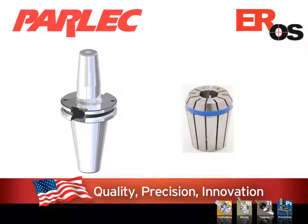Over time, when the bore of your shrink holder wears, you will need to replace it. It is quality scrap metal. The 2-micron collet of the ERos system can be replaced at a fraction of that expense, and as an added benefit, the identification band can be removed, and you will have a precision collet for your standard collet system.